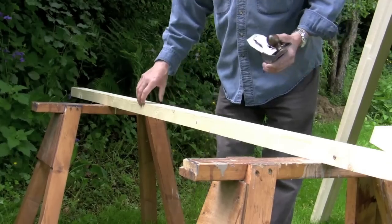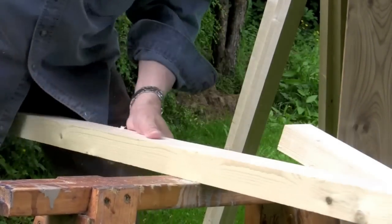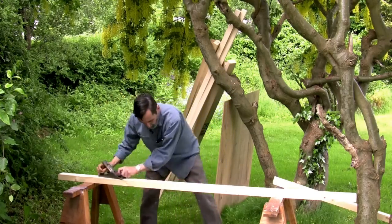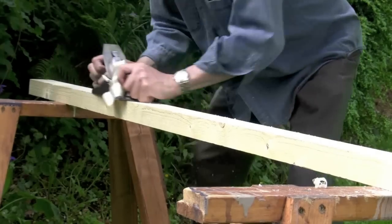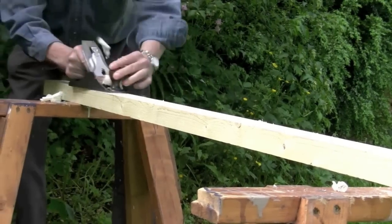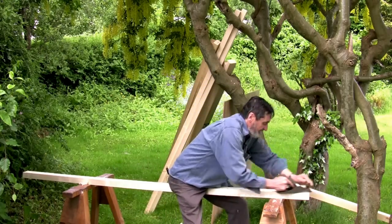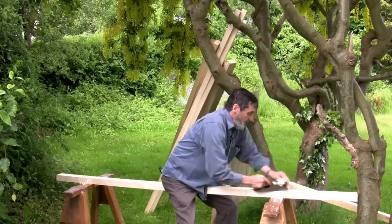Next one. This shouldn't take you really very long. This is real woodworking. When you take a stroke, don't stop and then pull back because it'll leave a staggered surface. Lift up on the heel of your plane like this — lift up every stroke. This makes a very stout workbench. Any of the pines, firs, any of those kinds of woods are wonderful for making a workbench. Don't let anybody persuade you that they're not as good as oak, cherry, or walnut.